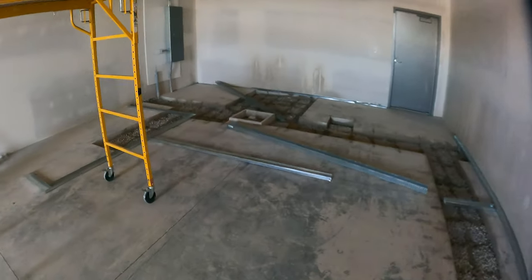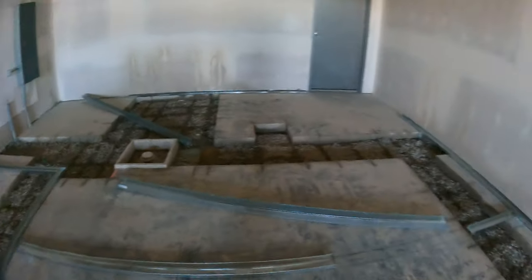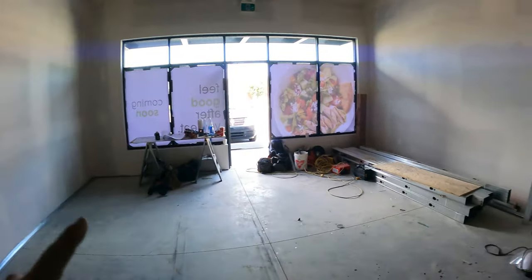I've drawn out all of my 16s. Working by myself on this job, I went ahead and laid out all my centers first. Now I'm going to hop up and start putting in 10-foot sections of track — this is a 12-foot ceiling, so I've got to start cutting studs.